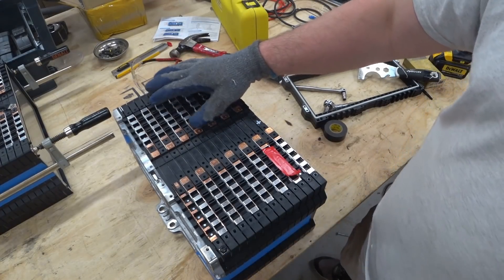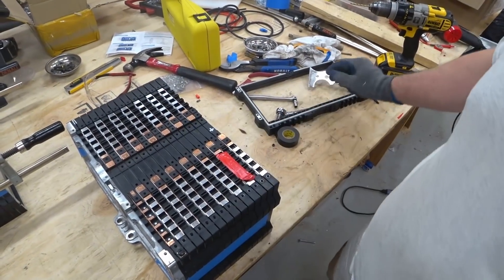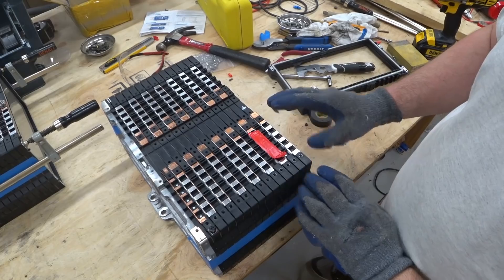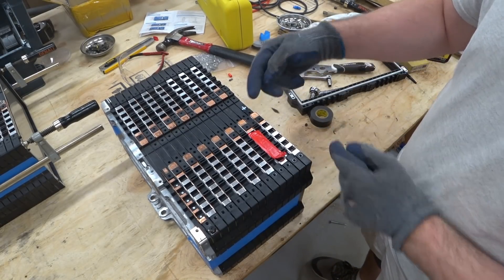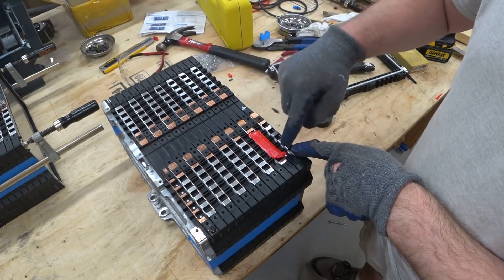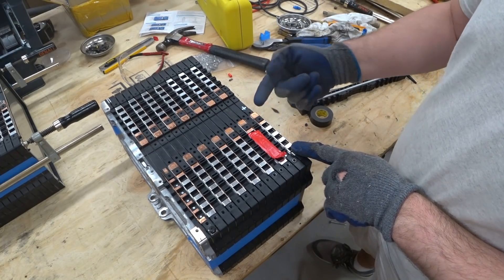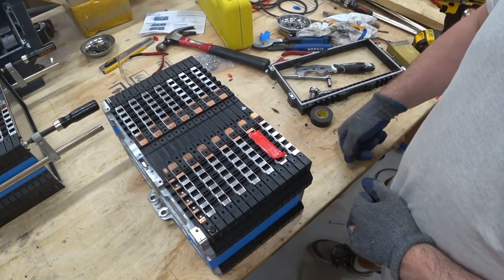This is the second half of the first battery — the first battery I was working on is over here. So while I was taking this one apart and prying this tab off, I had a thought of a possible way that this might be more efficient. I thought maybe I can pry this bus bar up a little bit and slip this piece of plastic out from underneath without dismantling these spot welds. So I'd like to give that a shot. Now before I pry that out, I'm going to go ahead and drill this hole, because once I cut that plastic from underneath, there's not going to be anything else to help support that.